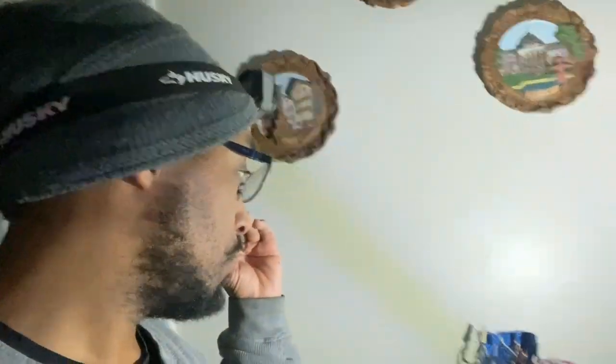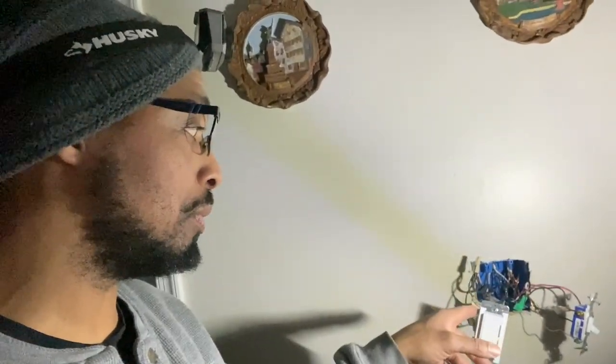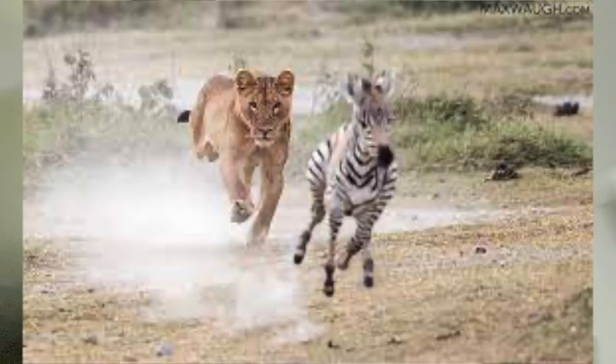The camera died on the main camera, so now I've got you on the phone. I'm done hooking up the single — I didn't do my three-way yet. I had to do some jumpers, especially for my neutral, because I need the neutral wire to dim the lights, and I had to jump my black wire too. I had to look for wire and tools — I wasn't properly prepared. I am sweating like crazy right now because it's a lot of work. We are about to turn on the breaker.